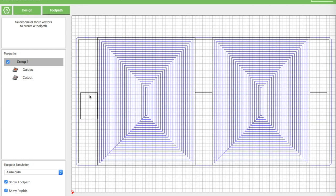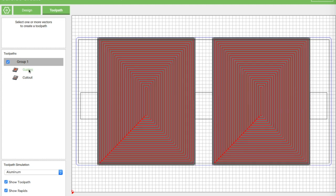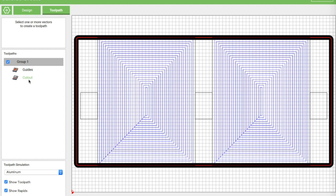Now what I did here is I just used these as spacers to make sure that I line this up with the piece that it fits above. So you've got a pocket here and then your cutout. And this will be the piece that sits underneath that holds our boards at a 90-degree angle.